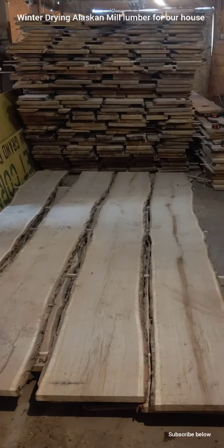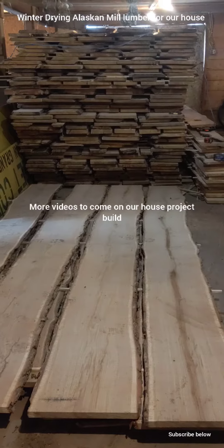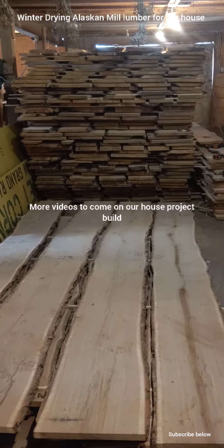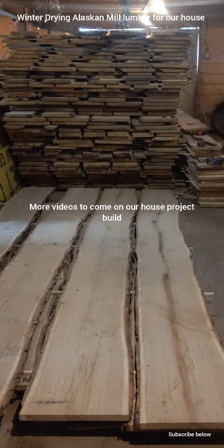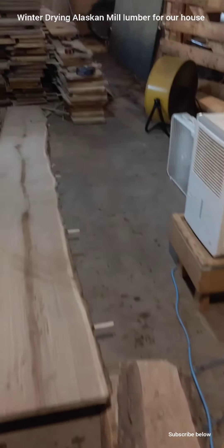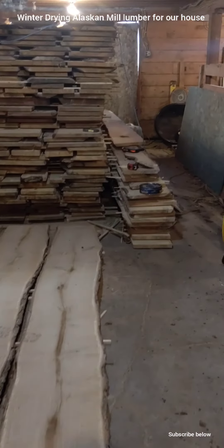Those beams were coming off at 45% moisture. I went in and thought the humidity in here seems kind of high even with all the venting I got going — we're at 70%. So I went and got two dehumidifiers in here and those are running full blast; we're pulling out 8 gallons of water a day.